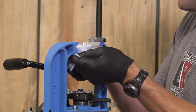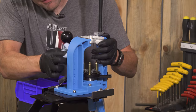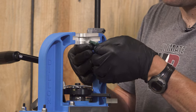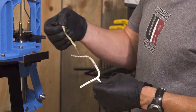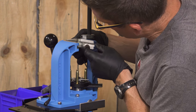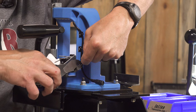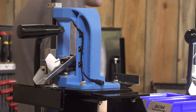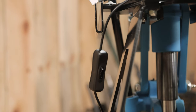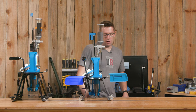Basically you're going to take the tool head out, degrease the areas where adhesive goes — which is under the tool head and where the little pads go to route the wire. Do a little scuffing, clean off any scuffing debris, then remove the backer from the adhesive for the light strip and set that in place. Once it sticks, it sticks — make sure it's oriented correctly. There are zip ties; the little pads stick onto the paint on the machine and zip ties hold the cable in place. Put the inline switch in place, connect the wall power adapter, plug everything together — good to go.